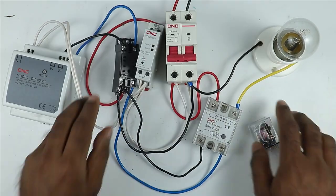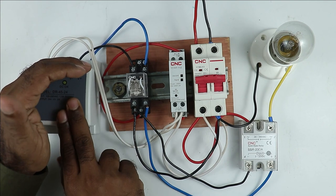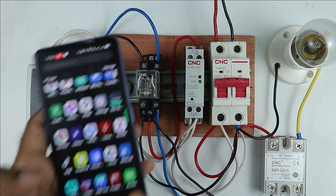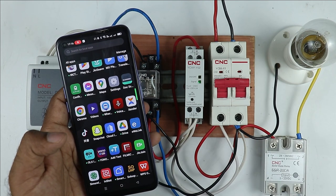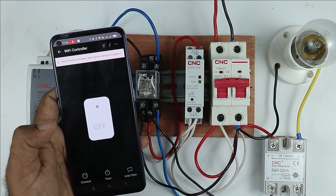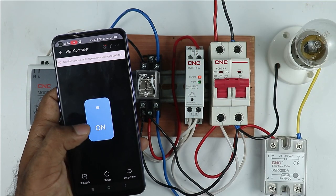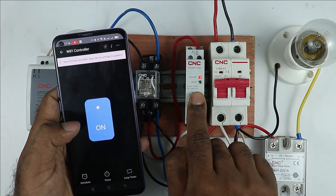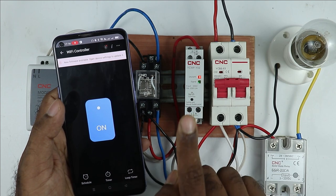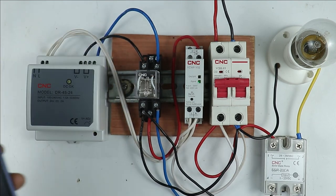Take one end of the wire and connect with the neutral terminal of the MCB — wiring is now fully completed. Let's fit this relay and turn on the MCB. After turning on the MCB, power is supplied to the SMPS and the indication is glowing. When this relay is on, only then will this SSR turn on. To control it through the smartphone, I am using the eWeLink app — I already connected this Wi-Fi controller to the app. I am pressing the button here. It didn't turn on. The Wi-Fi controller indicator is changing on and off with the mobile, but this controller is not turning on the relay — there may be some mistake in the wiring.